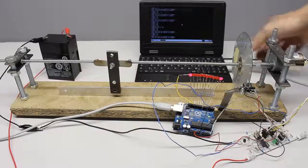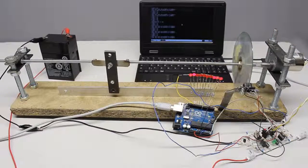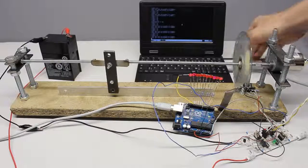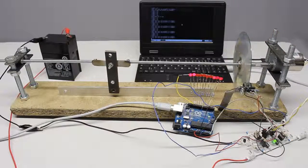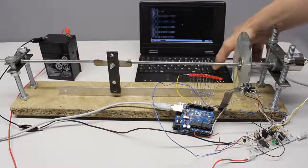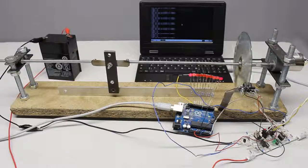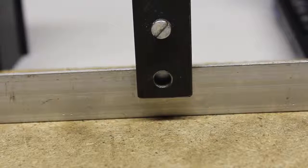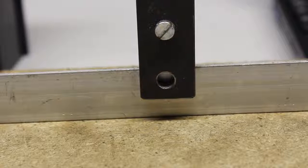The actual position of the pulse counter is compared to the set point, and the motor is driven by the microcontroller considering those input values. There is also a proportional, integral and derivative fraction implemented by software, not to forget the emergency stop if the mechanism is jamming. The construction is simple, but not very precise.